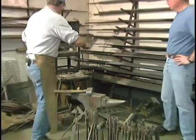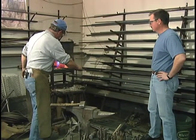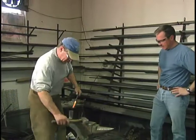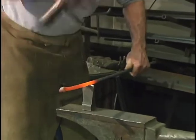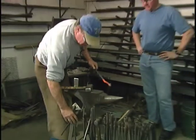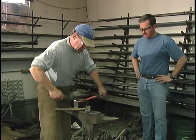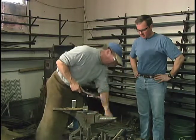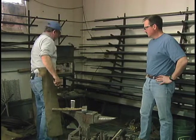What I'll do now is just flip it over. Okay, wow, you heated that up good. That is hot. What's that tool there that you put in the hammer? This is a hardy — it holds the chisel for me. The hardys come in different shapes depending on what you want to do with the metal. You can cut it square, you can cut it round, you can do whatever you want to do. Anything under the anvil, don't touch — it might be hot. So we'll put it back in here and make some kind of a handle for it.